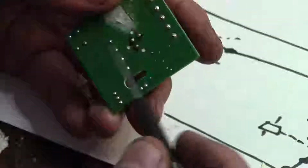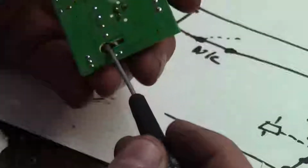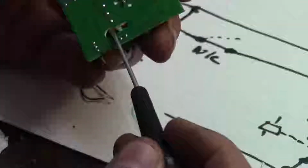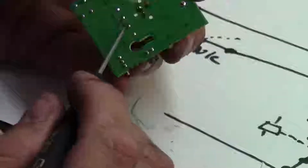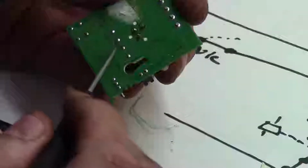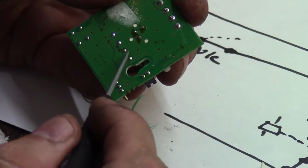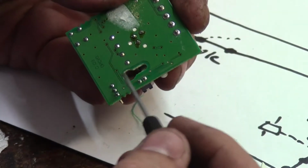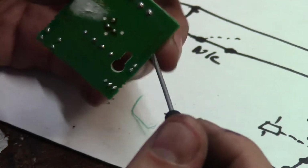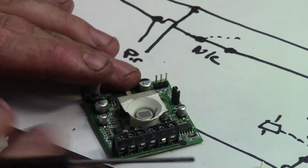So there's two ways to go about modifying this. We can either go and see which is the normally open contact on this relay, which looks like there might not be, because I only see 4 terminals here. So it'll be a coil, and then the 2 normally closed. If it had the third one, the normally open terminal, you could just run a wire out from there.